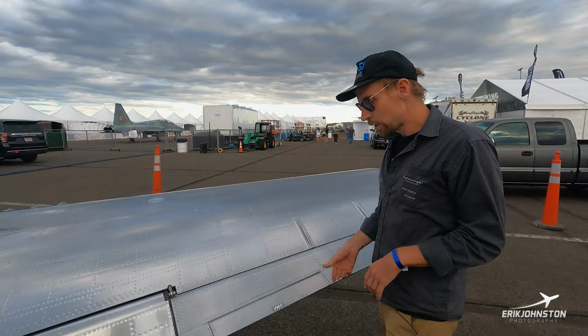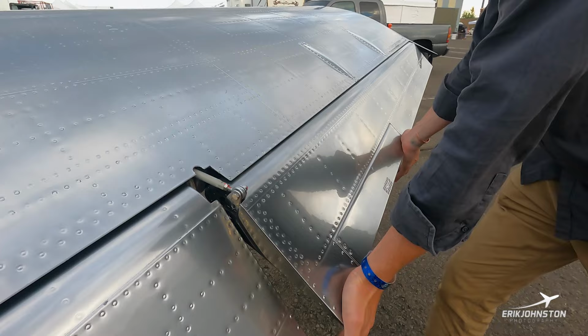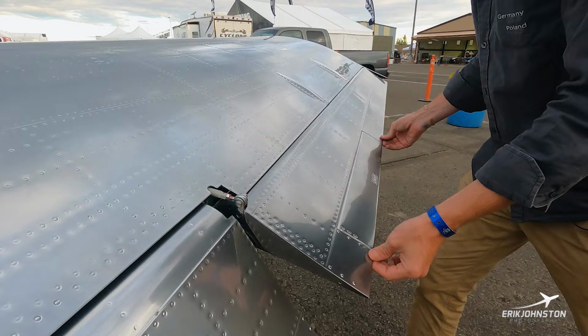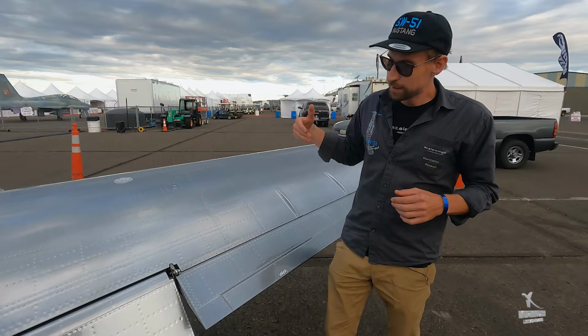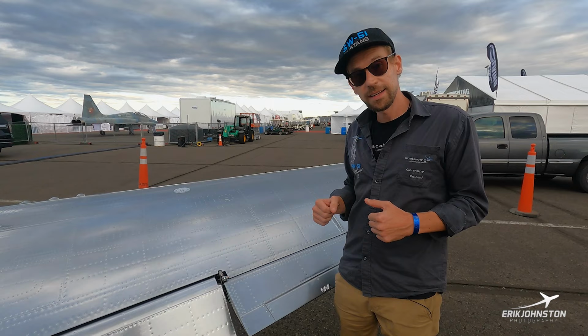Also, because the aileron is controlled by push-pull rods, which you can see here, there's almost no slop. I can show you the slop. So now I'm at full deflection, and now you see I have a lot of force. It's almost no slop. That makes them very, very efficient, which is also pretty good for the flutter speed. You know, the criteria for your VNE is mainly your flutter tendency, when this aircraft starts to have an issue with flutter. Our VNE is now 216 knots equivalent airspeed.